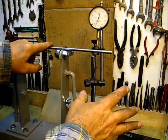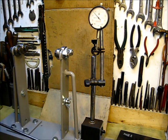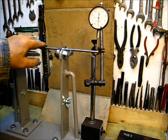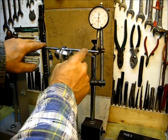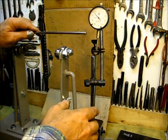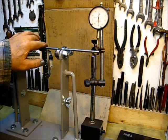It's half a thousandth. If I was actually going to do this, I would have the other indicator down there, probably in a different position where I would equal up. This happens to be five-sixteenths; this one is three-sixteenths. You see it operates in here too, and you would do the same thing — come over there. That one actually moves a little bit but it's not smooth. I would think it's a precision shaft because it doesn't move at all until it comes to a point. When you put the indicator on there, you do want some movement — you don't want it to even out right there. You want it under pressure like that. That's about fifty thousandths of deflection, but you can see that's pretty true also. That will work.